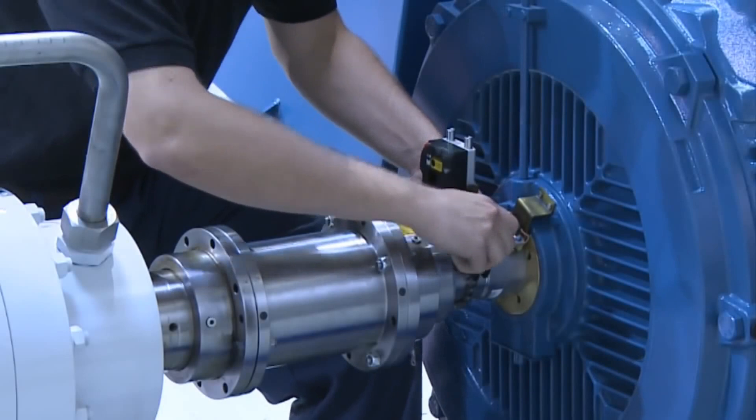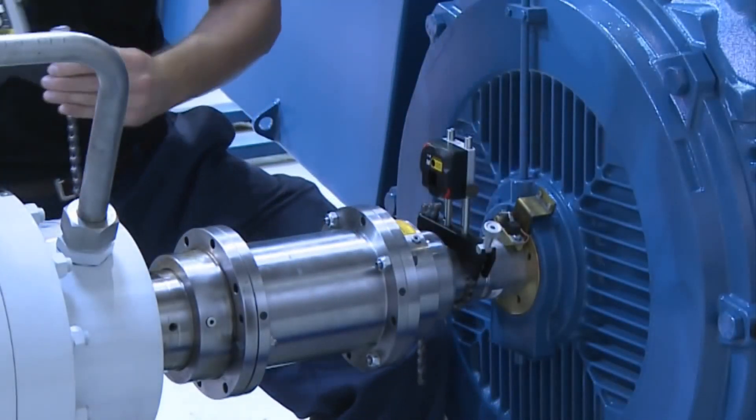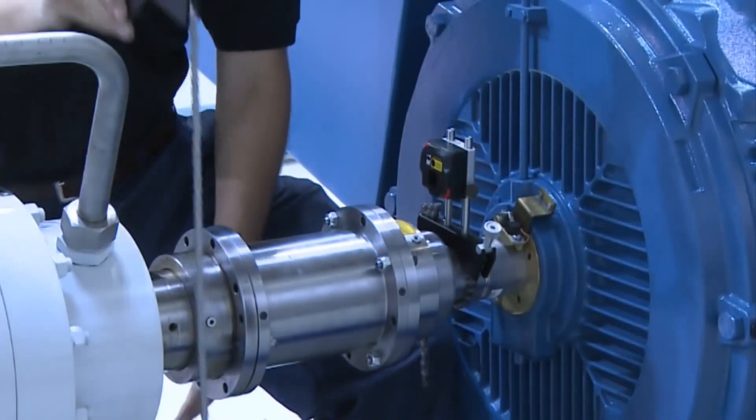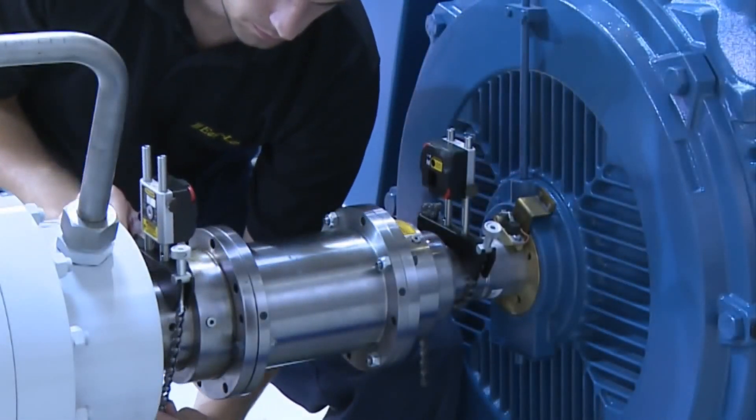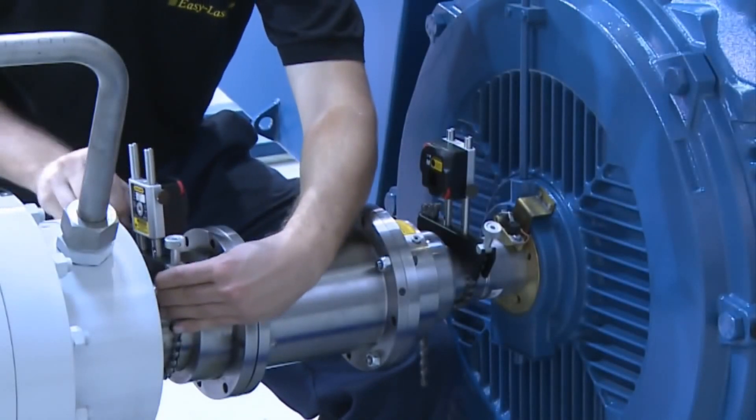As you can see, the measuring units are pre-mounted on the bracket and rods. All we need to do is hang the chain on the end of the bracket, wrap it around the shaft, hook it onto the pin, and tighten the nut, and your system is fully mounted.